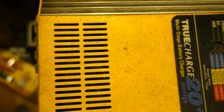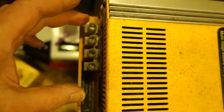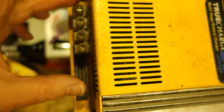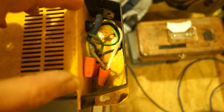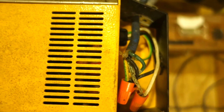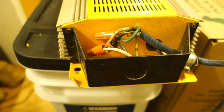When you have checked the fuses and replaced whichever ones are needed, you're just going to reverse the process. You're going to lower this end of the case down beyond these terminals, push it into its normal closed position. Then you'll be able to lower this end down, and at that point you just have to put the strain relief back on the wires, push it back into its hole, make sure that it's secure, and then replace the 8 screws, including the black power box, and you're done. Good luck.